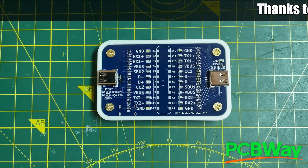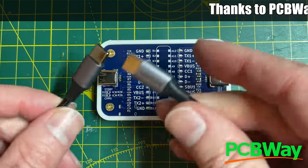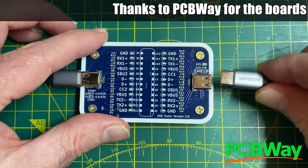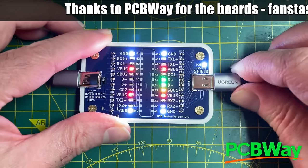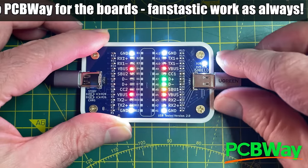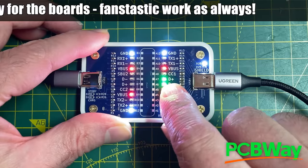I've made myself a little USB tester so let's try out this cable and plug in that end, and then we plug in this end. You can see this cable - it's pretty good but it's not going to do high speed USB because it's only got the two data lines.